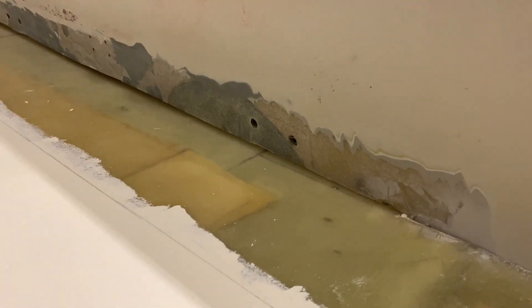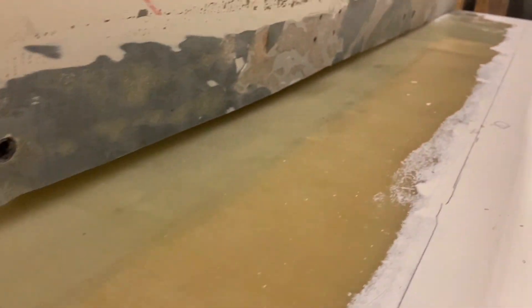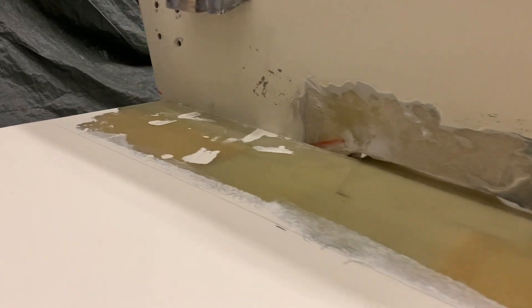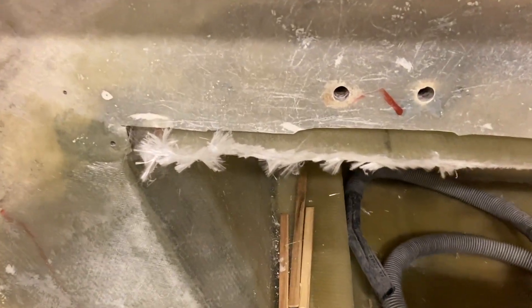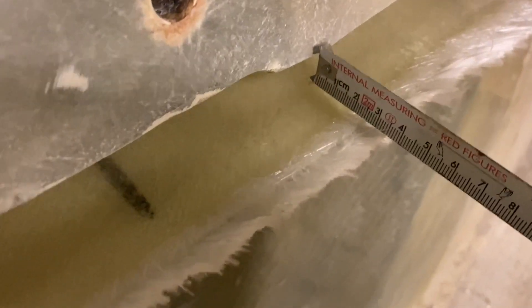I had to do some trimming but it works fine. What I'm going to do now is grind off some gel coat on the sides, and also push in some peanut butter again — between the transom and the lid — so I fill that gap out. Then I'm going to glass everything in. Here's the inside: it's not a big lip, but it's enough to have something to work against so I get this bonded solidly into the transom.